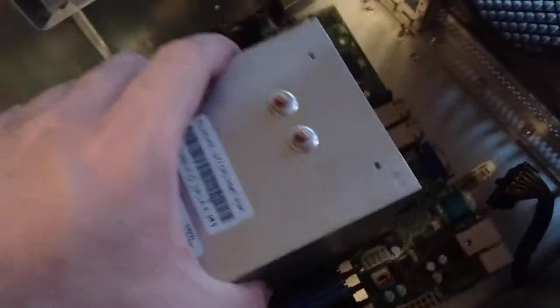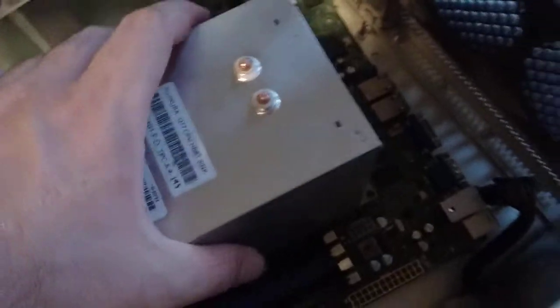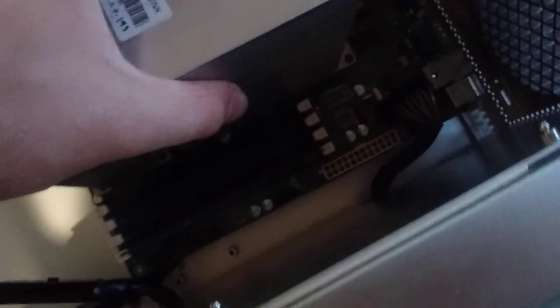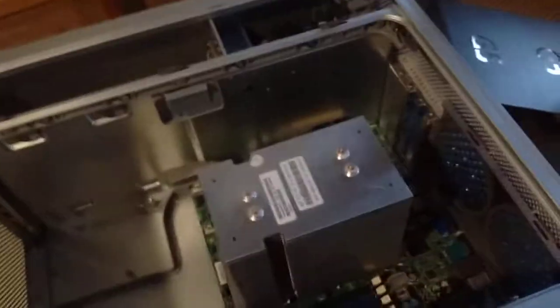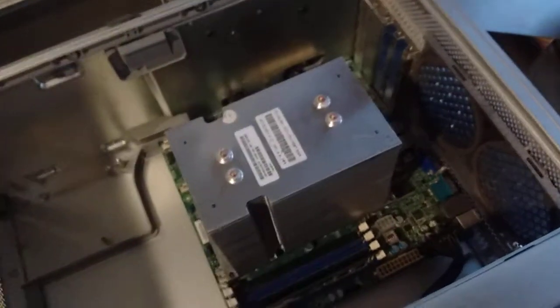This is the best part about this system — this is something I have never seen anyone do. I'm using the original power supply too. I am converting it to ATX. The only difference between this power supply and an ATX supply, apart from the form factor, is the fact that this does not output a power good signal. The power good signal is just a 5 volt TTL signal to tell the motherboard that the power supply has come up. So I'm just gonna bridge it to 5 volts, and that's it.